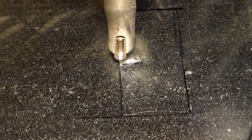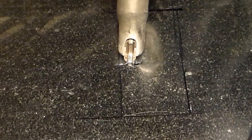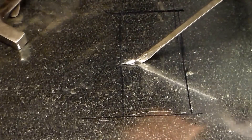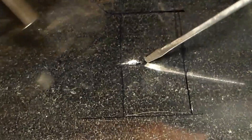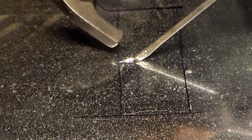I made my gouge close to the edge and it's going to take a little bit of finesse to get it inside and get it started inside this gouged hole. If you really want to, you can always make your gouge a little wider to make it easier. I've even seen guys gouging this way and then gouging an X in it, which works pretty well — but it's not 100% necessary.